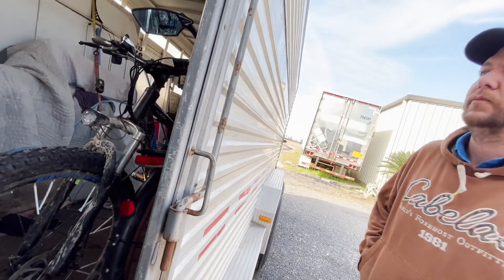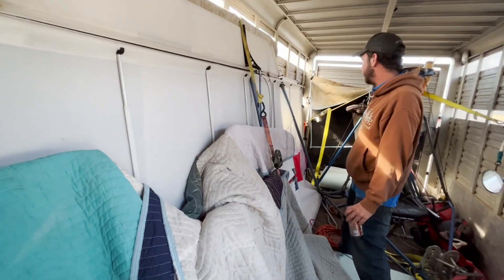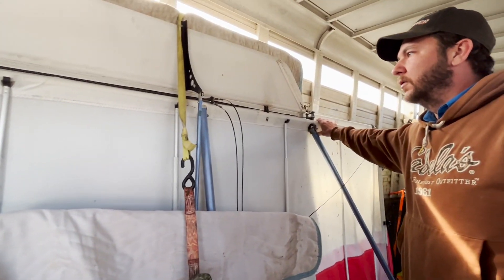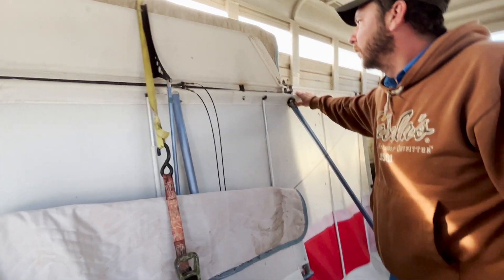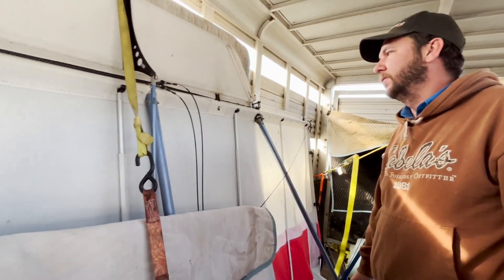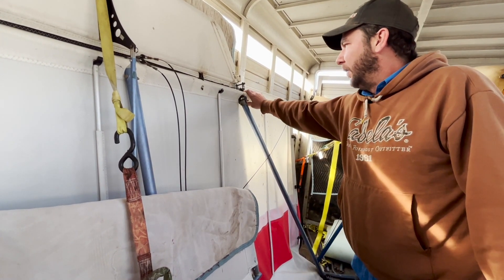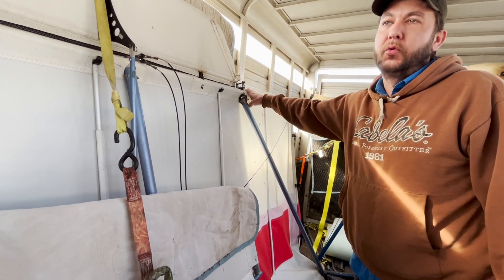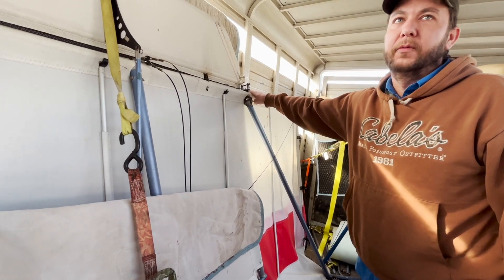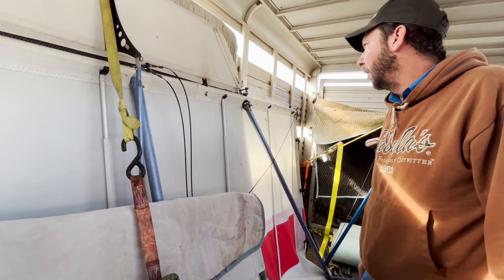Like I said, I was just going to have Beaver — whoever wants to look at it — look at it and give their opinions on it. I mean, it's just nuts and bolts. When's the last time you punch tested this ever? I've never — I've had the plane for not quite two years. I pushed on it pretty good at the seams, but what should it do? If you're pushing on this pretty good like I am right here and your thumb's not going through it, I can just about assure you my fabric tester's not going to go through it either. We'll punch test it for you just to give you peace of mind.